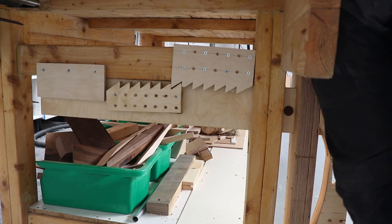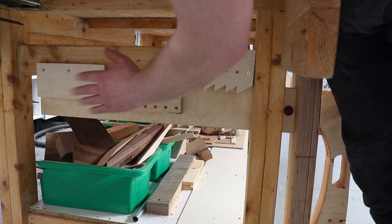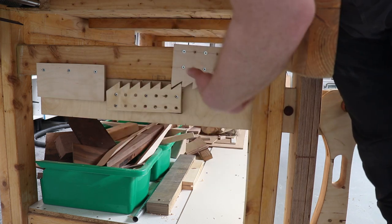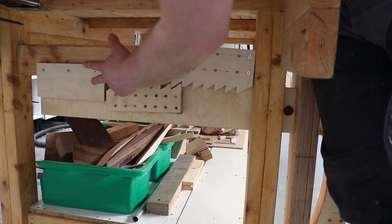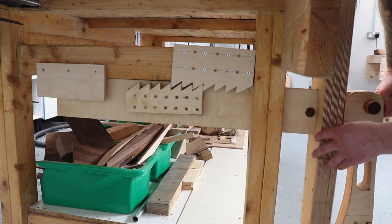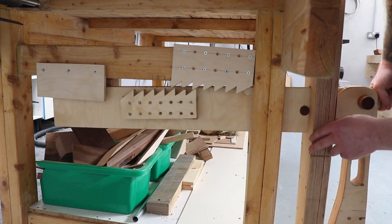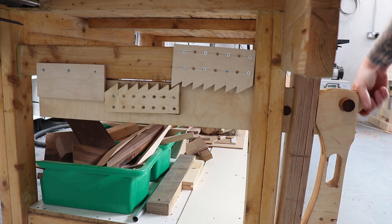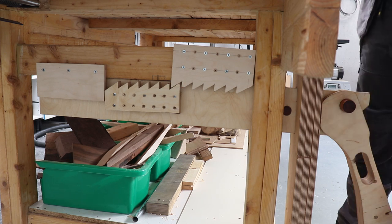Here is our mechanism now complete with two guide rails in place, one on each side. You can see how it works - just drop it down onto the next set of teeth, onto the next set of teeth, and so on, all the way out to about eight inches. Use your floor wedge in conjunction with that. Loosen it up, drop in your piece, and the clamp is in place - just like that.